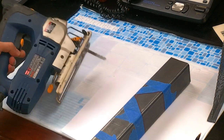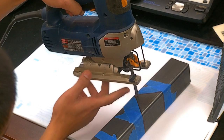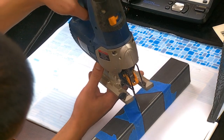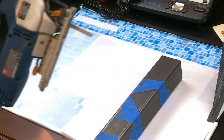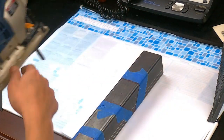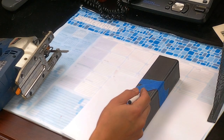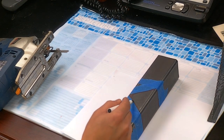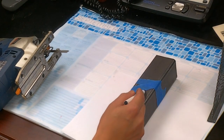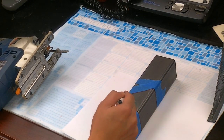After you drill the holes, use a jigsaw with a metal blade. Stick the blade right into the hole — the hole needs to be big enough for the blade to fit. Once it's in the hole, go this way with it, then this way. We also have another tool here. Go this way, turn it around, go the other way. This piece should be fully cut. Then pick up the jigsaw and cut back this way to finish off that corner. This piece back here stays intact — don't cut that. So we have the cut from this hole going this way, that way, and back this way to finish the corner.